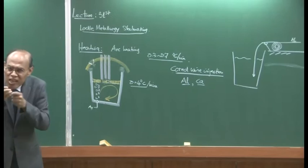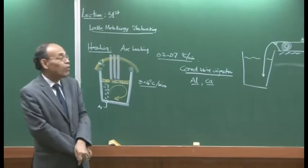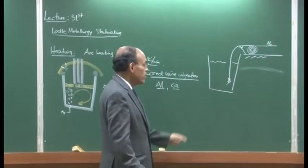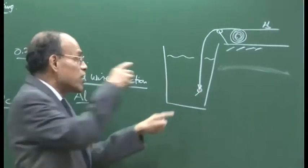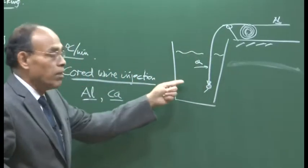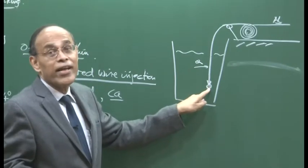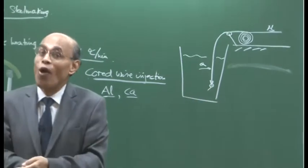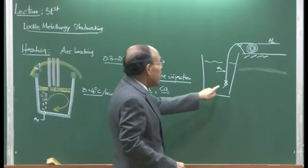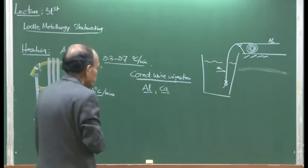So, that minute adjustment needs to be done with a sophisticated method, and that sophisticated method is aluminium wire feeding, because it ensures that aluminium is liquid here. Okay? It melts subsurface, so the wire is solid, and then as the wire gets progressively heated due to heat transfer from the melt to the wire surface, at some certain point of time the wire is going to melt. And these calculations are done a priori: for a given diameter, what should be the speed of the wire such that I can achieve a desired melting condition, 3 feet or 5 feet below the bath.